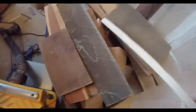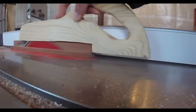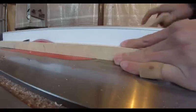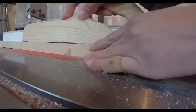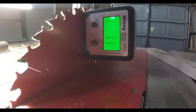With the body rings finished, I can now move on to what will become the second highest and second lowest segmented ring in the vase. It will be made out of maple and mahogany. I can rip strips of these two woods down to the appropriate width so that they can be cut on the table saw to make the rings.